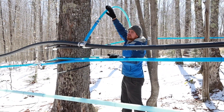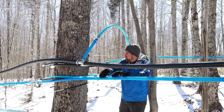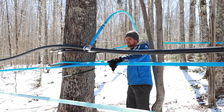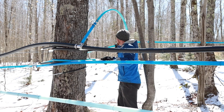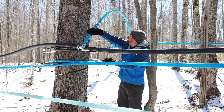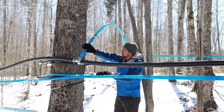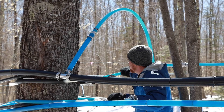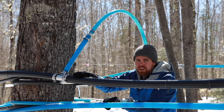Notice this large loop here — this is what we call a jumper. This spur line is feeding directly into this main line right below this tree, so that sap is coming in. The main line is under vacuum but there's not a lot of room for pulling air out of it. So we have this jumper coming from our dry line that's pulling all the air out of the spur. Because we don't want the sap traveling up into the dry line, the sap stays low and goes into our wet line main line while the air comes up into our dry line.